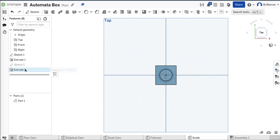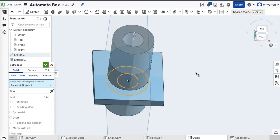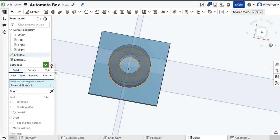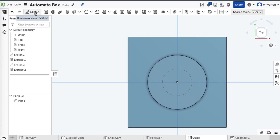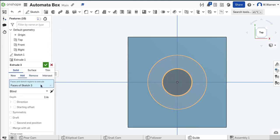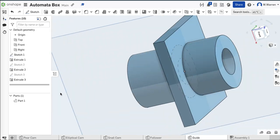The reason I held off on doing sketch one: I want to go back to sketch one and extrude just that hole. I tried to take a shortcut, but the easiest way is to just draw on this face and draw a 0.3 circle again. The 0.3, enter — then extrude to remove all the material, remove it. So now I just drilled a hole all the way through it. There's one of my guides.